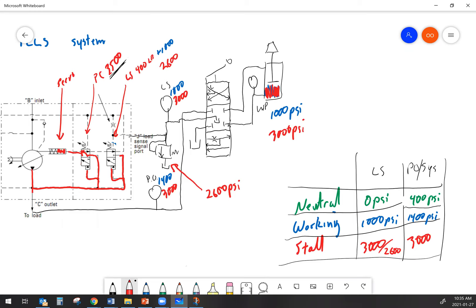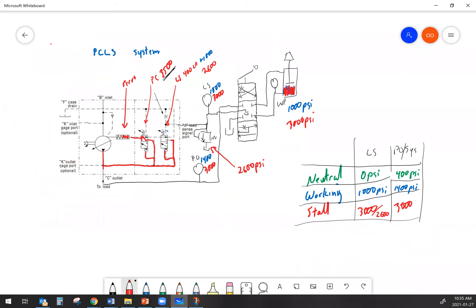This is something we're seeing on certain hydraulic systems, and there's a very good reason for it. In the next lesson, we'll be talking about post-spool flow compensation — a hydraulic system used on certain equipment where we want to make sure everything on the machine can function regardless of pressure and flow requirements. It's really a flow divider system, and for it to work we have to have a signal relief in there. In a lot of ag applications you don't see this, but in some ag and some heavy equipment you do.